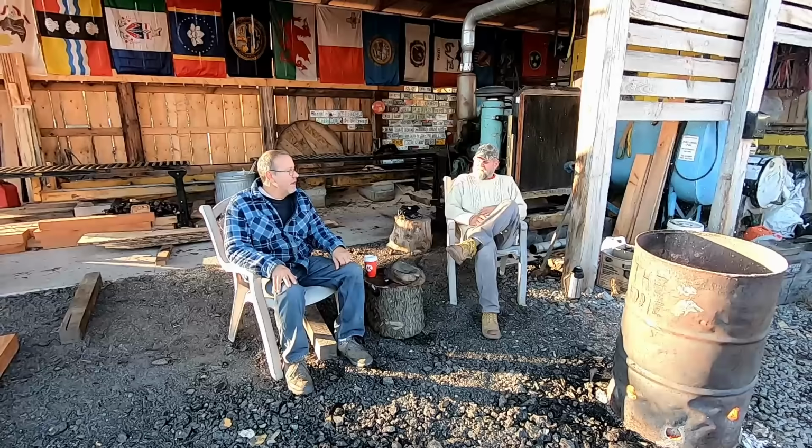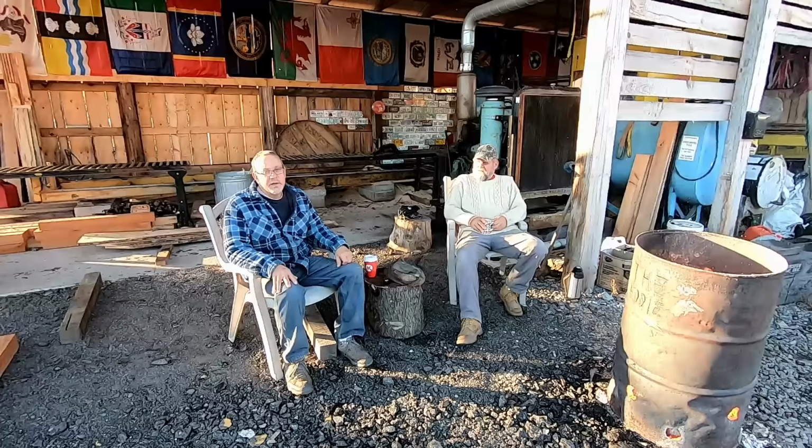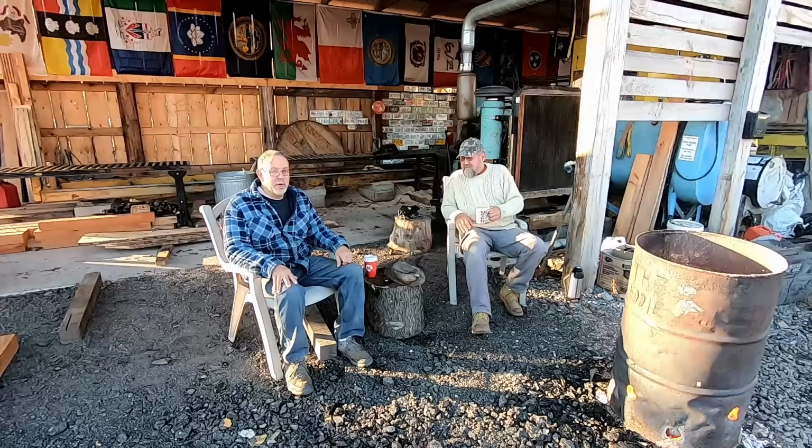If you own a band mill, I guess a $25 band is not that bad. But when you own a circle mill, like Jeep owns, and anybody who runs a circle head rig, you've got to really be careful because these are $3,000 blades. If you're lucky, you just destroy the teeth. If you're not lucky, you break the shoulders out and you've got problems. Or stick the saw.